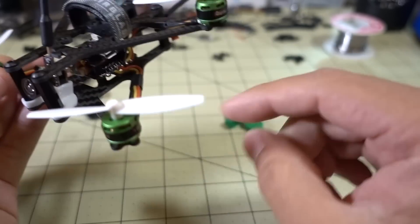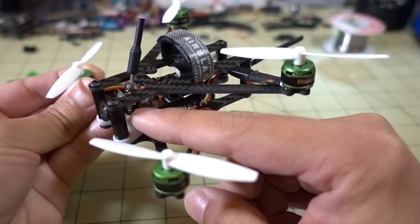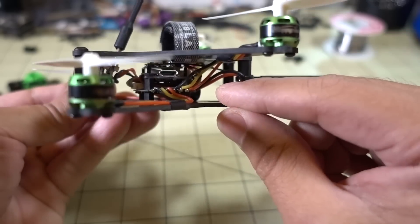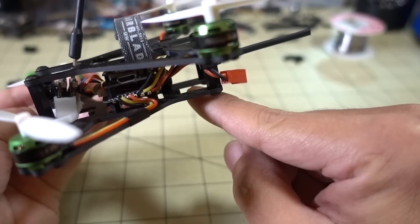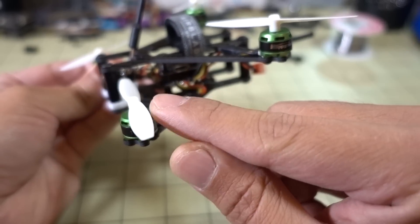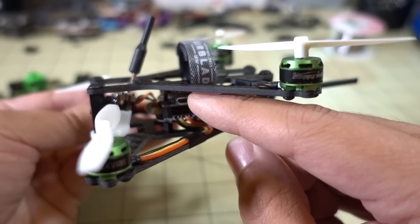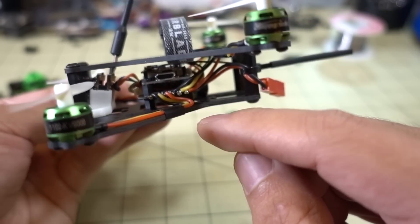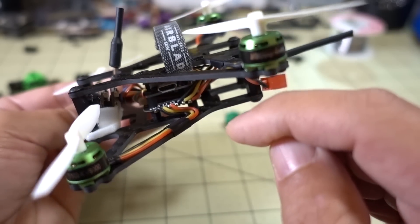This frame was actually meant for those micro CCD cameras — this is the included mount. It'll be pretty easy to convert this to the micro CCD camera mount. You just put on a micro CCD camera, then you have to wire it up with a separate micro video transmitter, mounted behind the camera or in the open space in the frame. If you go that route with the Super-S stack, the BEC on the board won't support the camera — you'd power the camera directly from LiPo voltage and power the video transmitter from the built-in BEC. Most micro CCD cameras can take direct LiPo voltage, so that shouldn't be an issue.